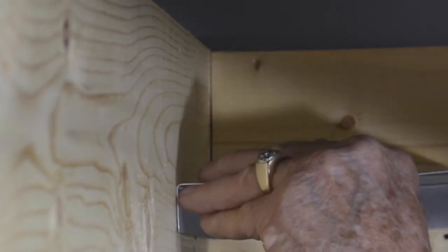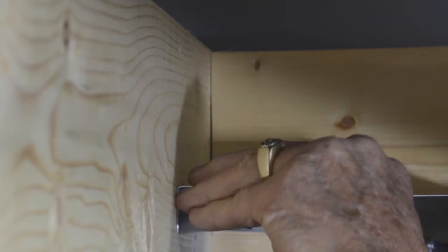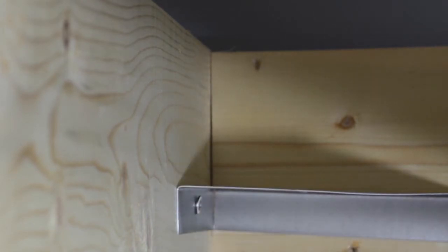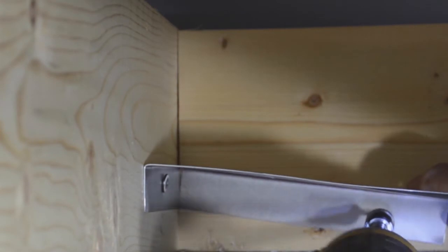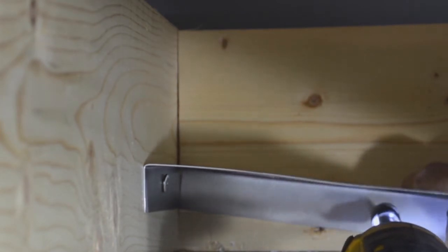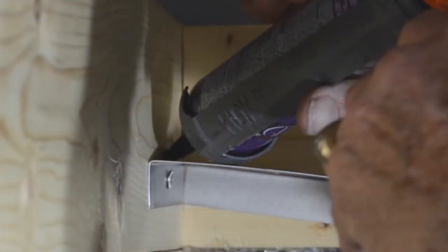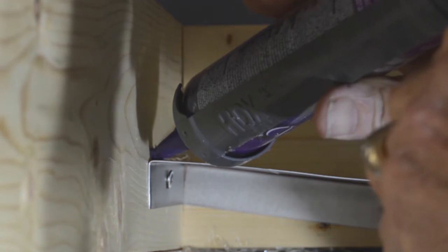A corner cap is also attached to the structure above every corner box. It provides a double layer of protection against leaks. Be certain the corner cap is tilted downward for drainage. Any water that falls on it is directed onto the wall channels or onto the ceiling panels. Seal the corner caps.